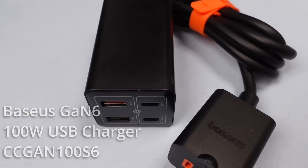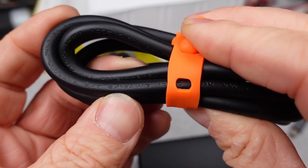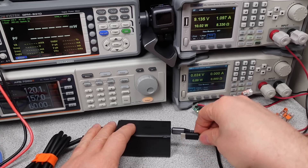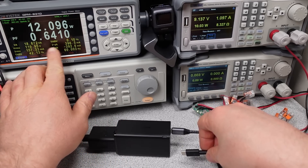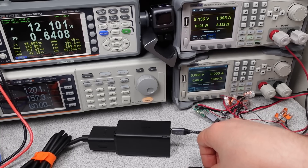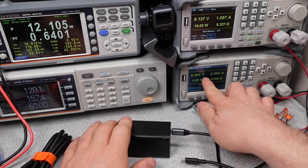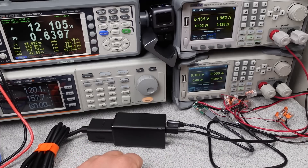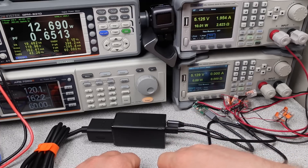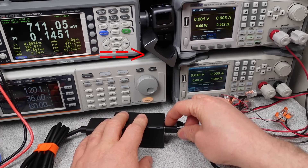Strikes, and you are out. This power adapter is not for me, in my opinion. It doesn't function as well as a power supply versus previous power adapters, and then has some other features that I don't think really make up for the performance deficit. Ultimately, it's a power adapter. On the positive, it comes with an extension cord and does negotiate faster - a lot faster. The power distribution makes sense for actual devices being used. So GAN6, for me, looks like it's a no-go. I have two other ones here in this series, and I'm debating even bothering if this is setting the bar. The main thing here is 3% worse overall efficiency, which looks like it's not a big deal, but when you are trying to save as much energy as possible, it is. Thanks for watching - the Anker 240-watt adapter is next. That was the hidden item: the stand was in the shot, under the robot. Told you - not that interesting. Goodbye.